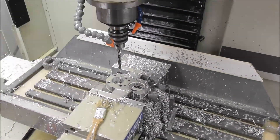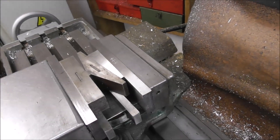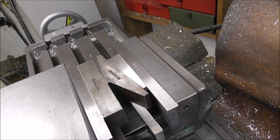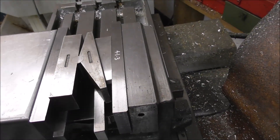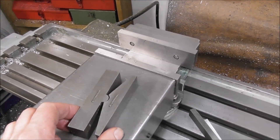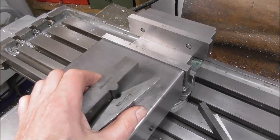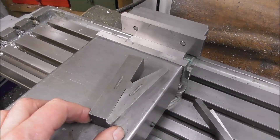If you want to hold tapered work, a pivoting parallel is very useful. I don't know whether you can buy these, but they're simple enough to make. You just drill and ream something like a half-inch dowel hole in the middle of a block, then saw it out and fit the dowel into this sort of shape. You've then got a pivoting support block — or pivoting clamp block — for a vise or similar situation. It's just got a dowel mounted to one half, and the remaining hole from the dowel is your pivoting seat, then you just saw away clearance to accommodate different angles. Thanks for watching, catch you next time!